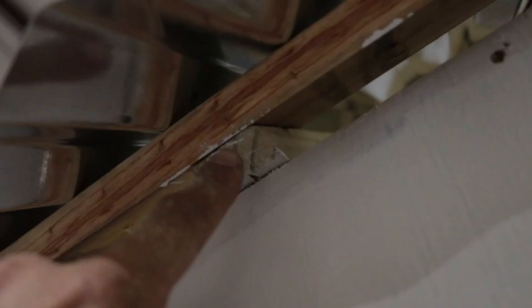Where the roof meets the wall, we've got this gap right here, which is about 3/4 of an inch. And the reason for that gap is because the rafters hung off a little bit, which is what I wanted, because what we're gonna do is put a trim board up there that's gonna sit right up tight to this, and that will look pretty nice.